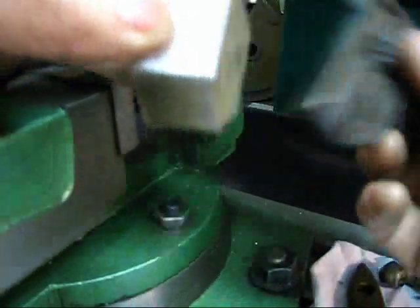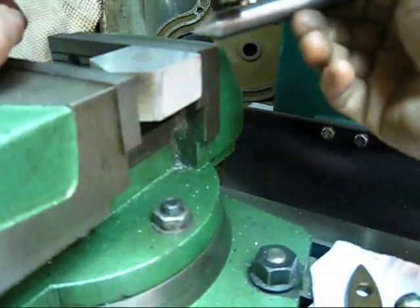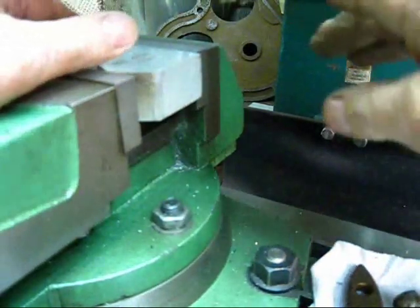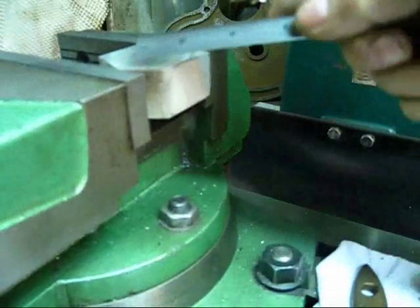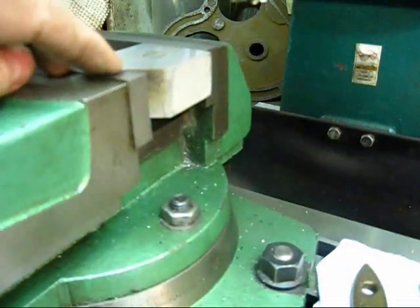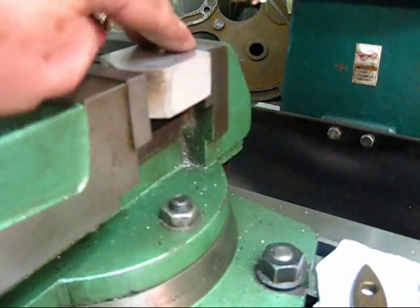First off, there are no two sides on it that are square. The back side is square to the face both ways, so I'm going to use that as the reference point. I'm just not much on measuring. The top of my vise jaw is parallel to the head on my machine. Now that's level, so I'm going to tighten it up. I used this point here on the side of the jaw so the level matched up. Had this not had a point here, I would have put a round piece of stock on one side so it can pivot and find its own levelness.